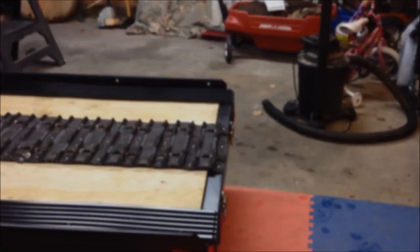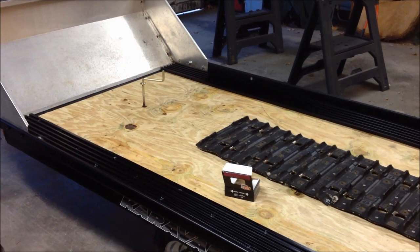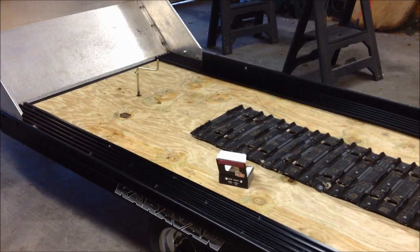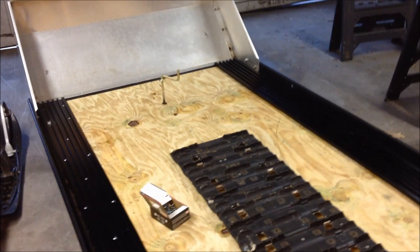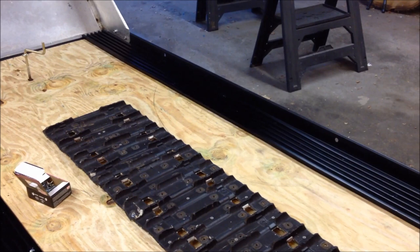The material has been painted. I used a couple different cans of paint. As a base layer or primer I used leftover Krylon Fusion paint — that stuff is specifically made for plastic. I only had one can so I didn't want to buy another, so I used the Krylon Fusion as a primer with two coats on each piece. Then I finished it up with Krylon satin paint to take some of the gloss off, since the Fusion was a full gloss.